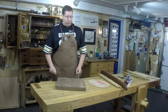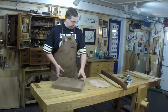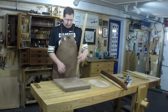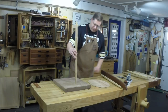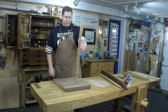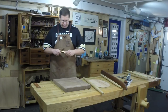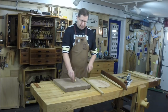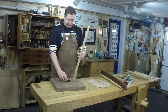For the purposes of this demo, we're just going to suspend the explanations and say, we figured out that the resultant angle is 10 degrees here. So as I put this leg on the line and I sight down my sight line and go out 10 degrees, that's where it's going to go. So all I've got to do is set a bevel gauge to 10 degrees. This is not 10 degrees, this is just me explaining. So I've got this bevel gauge set up at 10 degrees.